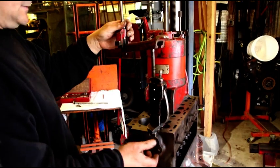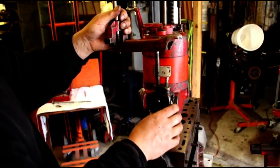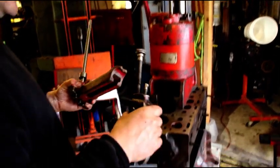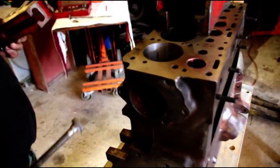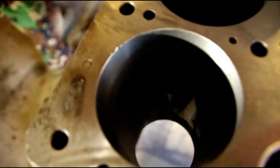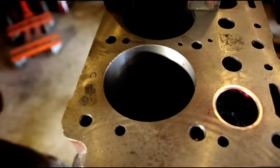This is what you can't see — this piece is in the cylinder. It hooks onto a shelf inside the boring bar, and when you put pressure with this screw it jacks this up and pulls it tight against the underside. We just finished number one, and I like to jump around — I'm going to do number four next, then come back and do number two, then number three. The cylinders don't really get hot, but I don't like to do them in succession.